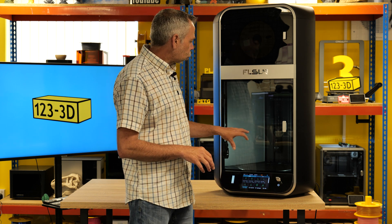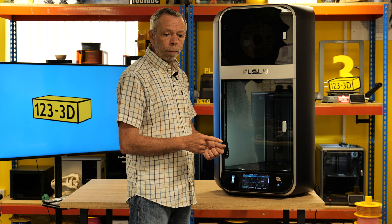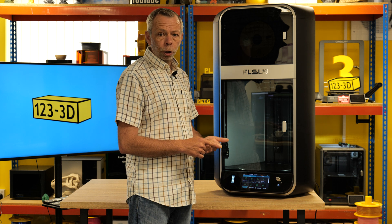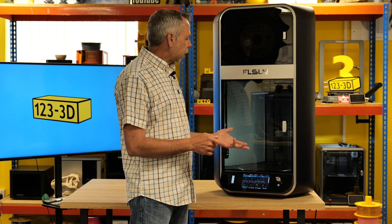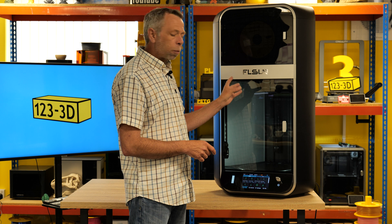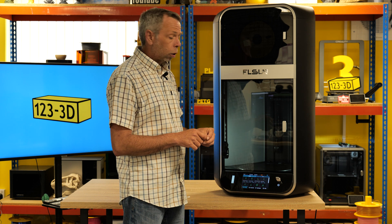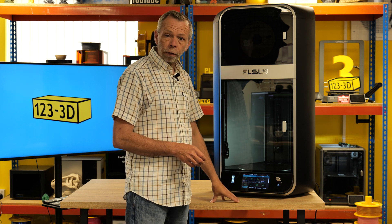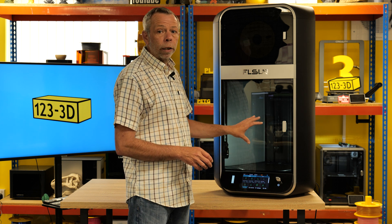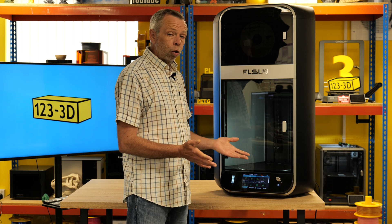The machine is currently configured for FLSun Slicer, which has pretty much all the key features you'd expect and looks very similar to PrusaSlicer and OrcaSlicer. Creating an OrcaSlicer profile for this machine would not be hard at all. You have full remote access via FLSun slicing software — slice your files, send them over Wi-Fi, press print, monitor them, and you're good to go. My overall thoughts: with the size of the build plate, it opens up a lot of scope for what you can make, from rapid prototyping to large components to small-scale production. This machine can print PLA, ABS, PETG, and ASA. I wouldn't recommend high-speed TPU, though the machine will print TPU at reduced speed. I also wouldn't recommend having it on a table — it definitely wants to be on a solid base or stable worktop.